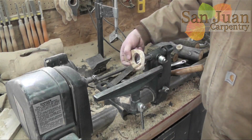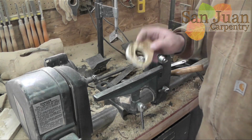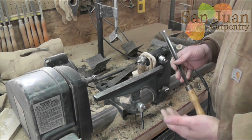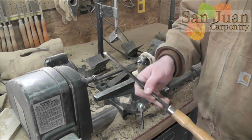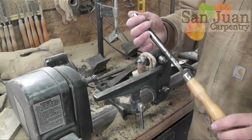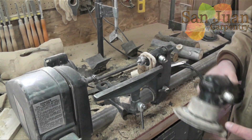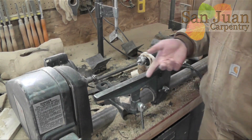The tools you're going to need: first of all, the lathe, and also an inch and five-eighths pattern. The reason it's inch and five-eighths is because that's the size hole I drilled in my legs, which the tenons are going to be going into. You also need a knife — I'm not really a lathe expert, this is really the only thing I use a lathe for. I don't even know what this knife is called, so if you are a lathe expert, please comment below and tell us what it's called. You'll also need a draw knife to take off any bark, your sanders — I have two, one with 120 and one with 180 — and possibly a hand saw to cut off knots if those are in the way.